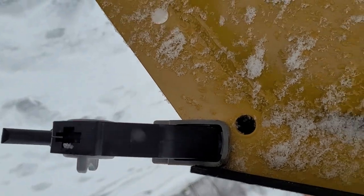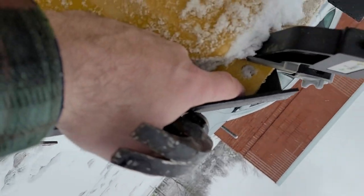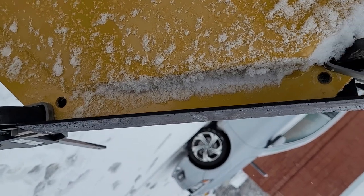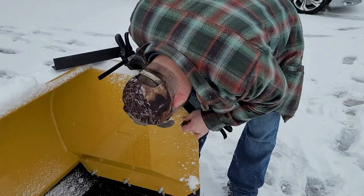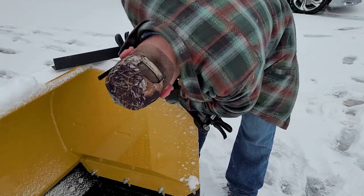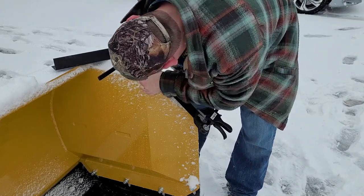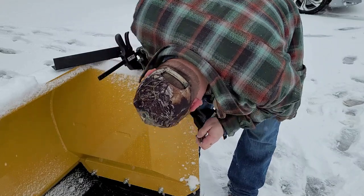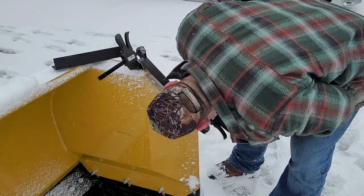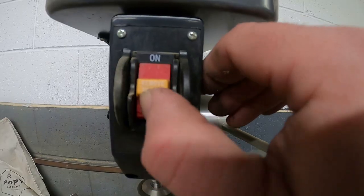So what I'm gonna do is I'm just gonna punch a little center punch there in both of these. This guy here. So I know where to drill. And then do the same thing on the other side. Scratch. Just a little scratch. Yep. Do the same thing with the other side. And I need to make sure the bolt I'm picking, the diameter will fit. Yep. Right diameter.